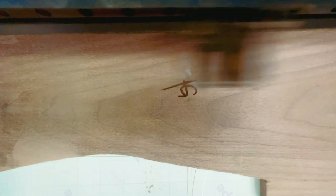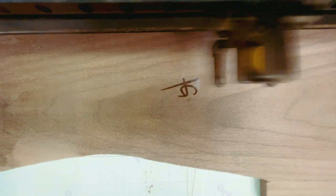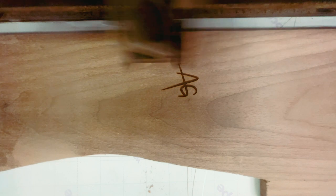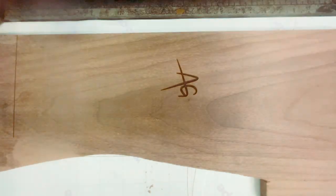This is what I was talking about. I do have something here that a lot of you presumably won't have access to, and that is a laser engraver. So I'm laser burning a few things here. The first thing I'm laser burning in is my logo. This is going to be an inlay. I could also do this on a CNC carver, and I know actually a surprising amount of people have CNC carvers now, but I'm using the laser. I'm more familiar with it, and it makes a nice clean cut. I don't have to worry about tear out or anything, and it gets perfectly deep enough for me to be able to do an inlay. And it's going to be a powder inlay, as I'll show you.